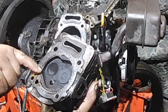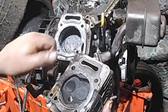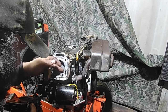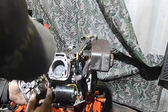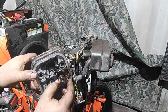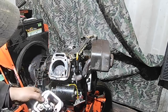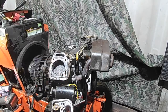You can see this is where the gasket gets compromised right here - it's a little bit cleaner here. That's where the exhaust was pushing through, into this port here and down into the crankcase. What you can see is the gasket is compromised here. There's a piece of gasket right here. This hole here is an oil drain galley - there's a small hole down here in the back of this head where the oil drains back into the crankcase. This is where it was getting pressurized and compromised - the exhaust was going in there, blowing up here. We saw smoke coming out of here, also blowing down here into the crankcase and coming back up through the breather.